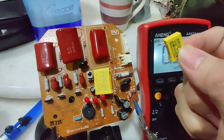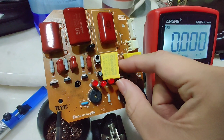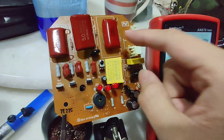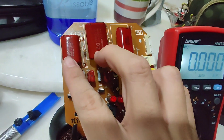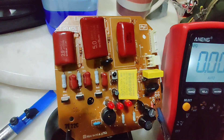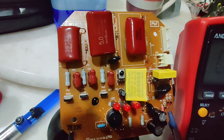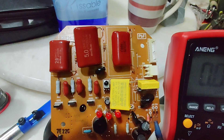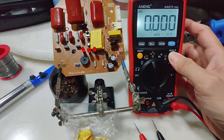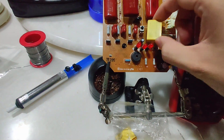What you do is measure each of these capacitors and make sure the reading is within range. For three of these capacitors you can test while they're on the board, but for the other two you have to unsolder one leg in order to test them, because there's a resistor between the two terminals which will not allow you to measure capacitance while it's still soldered onto the board.